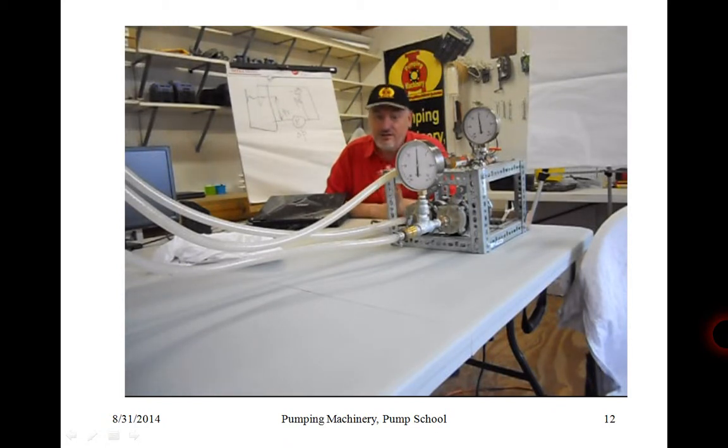So it is important. Gauge positioning, presence of gauges, and proper calibration make a difference in whether a pump passes specification or not, and whether the pump is consuming the energy you think it is consuming versus what it is really consuming. In the next pump video, our candidates will continue talking about energy topics, reliability topics, mechanical seals, bearings, and other subjects. Specifically for energy, in the next Pump School in Atlanta — a two-day seminar on September 10th and 11th — we'll discuss this topic and others in much greater detail.